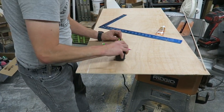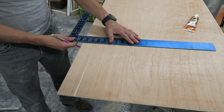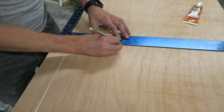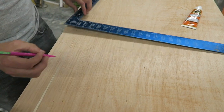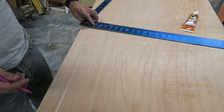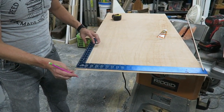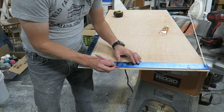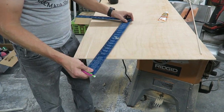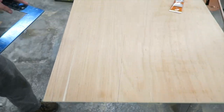I'm going to come down two and a half inches on each side and draw another line. Then from there I'm going to draw a line going in one inch on each side. Nine inches over to one inch is eight — there's your line for that first cut. Then I'll come down and measure one inch in from each side to give the angle of the display. I'll put a mark at one inch, and then over eight inches because it's nine inches wide, and draw my diagonal on both sides.